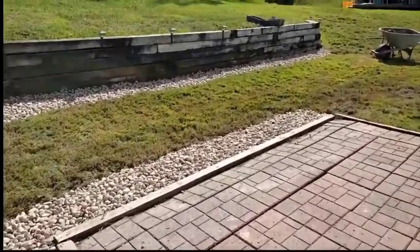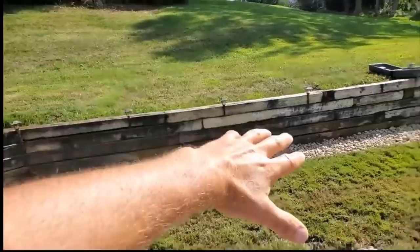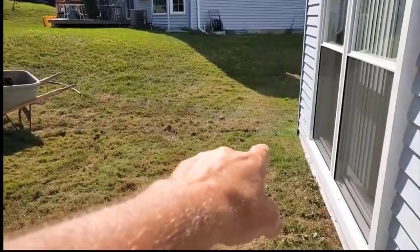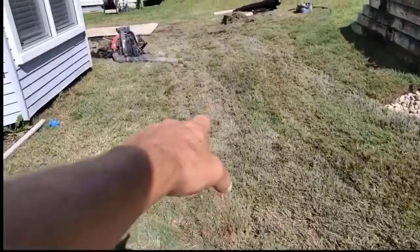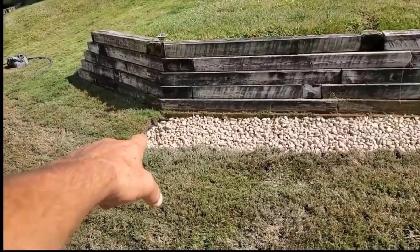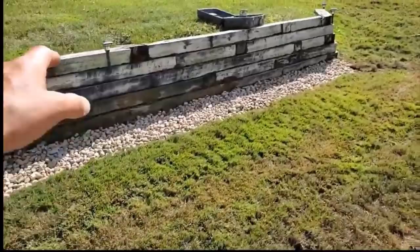So when the flash floods happen and all that water is coming out of that cul-de-sac and just pouring down the steep grade, it's just insane. So we got a curtain drain that starts right there, and it's covered until this point, and then we're grabbing up bulk water with an open French drain, and it ties into that blind inlet along with this. So we got grass covering here, and then we go to an open, I mean, water will go through that stone so fast, it's nearly uninterrupted.